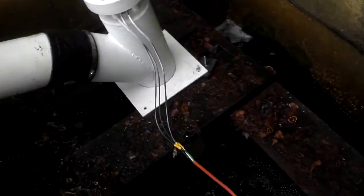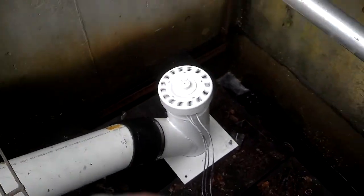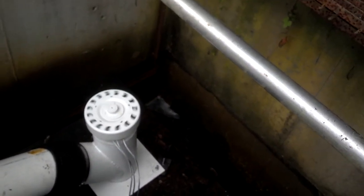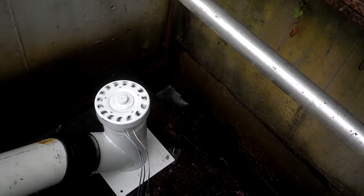There's a dam pipe — I don't know if you can see it, but it's up under the water. It's actually sucking the water through the turbine, and that's where it's turning. The open voltage on this is about 120 volts DC, and AC is probably about 85 through my inverter.